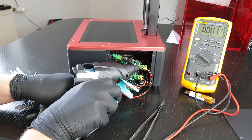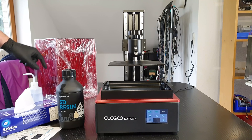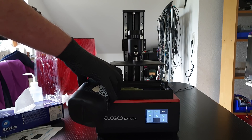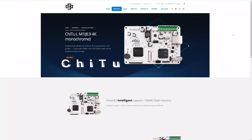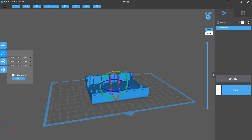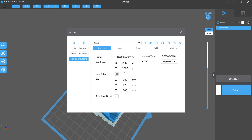I'm fixing that myself the authentic way. Now we can start pouring in some resin — ideally without my harsh video lights curing the stuff halfway between bottle and vat. Like practically all other consumer-grade MSLA machines, this thing is based on CBD hardware. They develop the driver boards for masking LCDs used in all AnyCubics, Crealities, FlashForges, and so forth, as well as a very good slicer software for all of them. It's updated often, but at the time of this video it doesn't yet know the final parameters of the Elegoo Saturn, so I'm entering the new parameters from the manual manually.